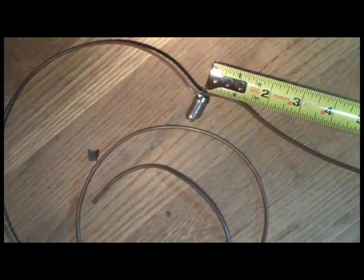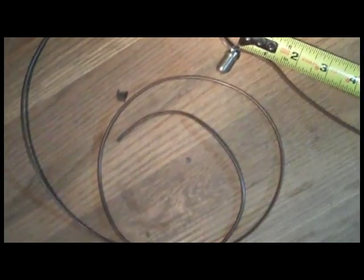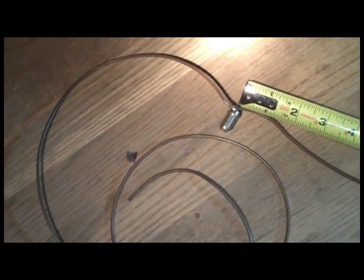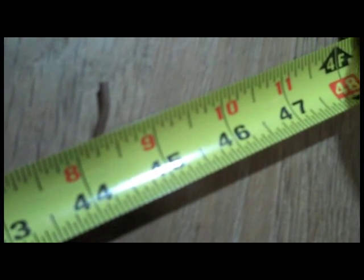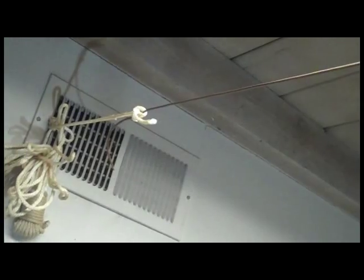Here's the connector end of the antenna and both leads. I just used a piece of lamp zip cord and pulled the two leads apart, and right here is the F connector. We have a little bit over 44 inches — I'm about at 44 and a half. I can trim that down in the fine tuning; it's good to go a little bit long and then tune it down instead of ending up short. Here's our antenna hanging from the ceiling, just tied from the heater vent to a nail. You need to isolate it with rope so it doesn't touch anything.